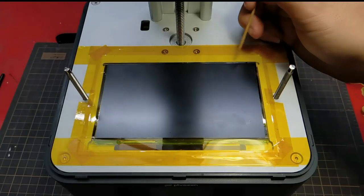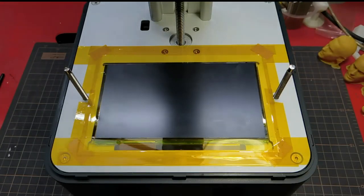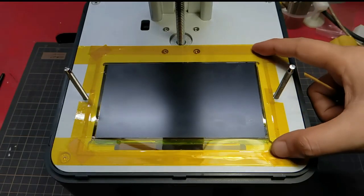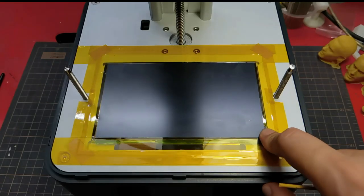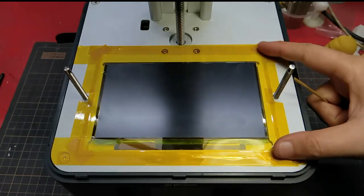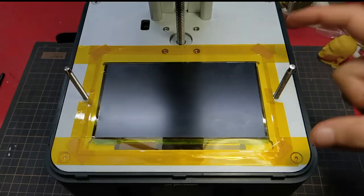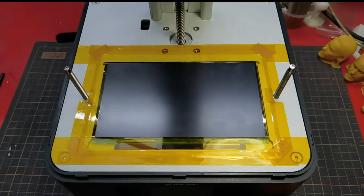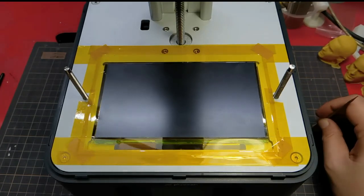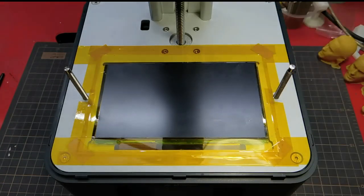Next, this could be a problem or not depending on how you look at it — I wanted to install a screen guard. The black tape around the screen creates air pockets that could cause problems during leveling and could end up causing bed print lines. So I removed the whole black tape, installed my screen guard, and then applied Kapton tape. I'm using an anti-glare or matte surface screen guard to avoid the film sticking to it.